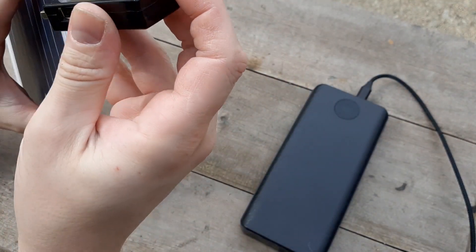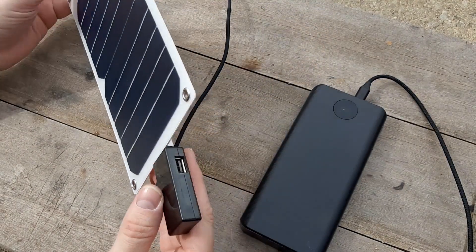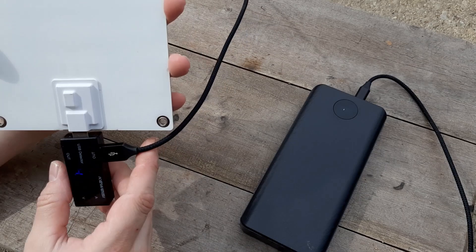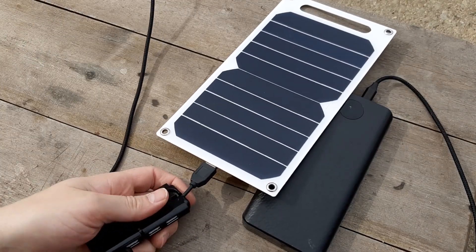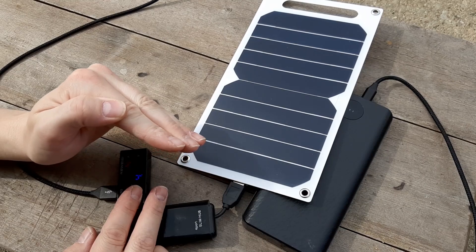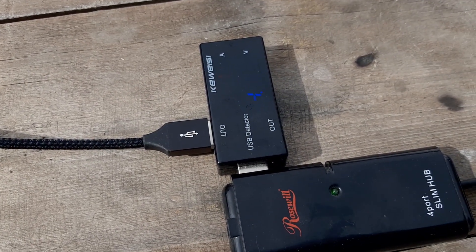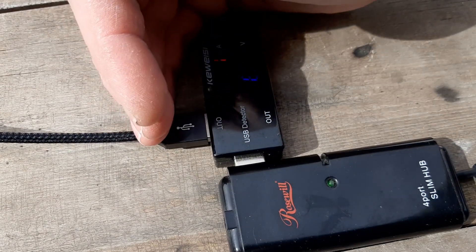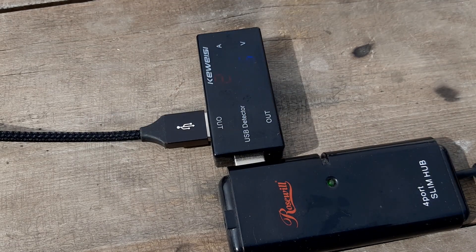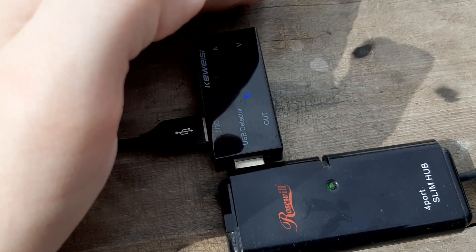Got the little measuring device — you can see it goes into the circuit with no off-board cable, so you have to bring your own cable. I realized the only way to read it is to face it away from the sun, and it's actually getting pretty good voltage from the refracted sunlight. After failing to find a short USB extension, I put it through a four-port hub that's complete garbage and predates 10-watt USB — so take that with a grain of salt. There were some clouds and a little haze the day I filmed, and at around 4:30 it was all over the place, but getting about five volts and upwards of 0.4 amps — so only about two watts. Angling it really well during the later follow-up test got about three watts, which is three times as powerful as the small one.